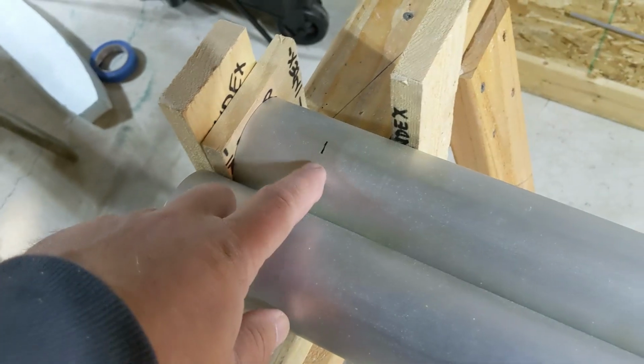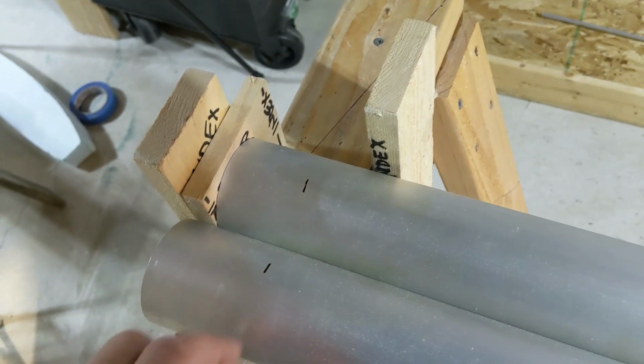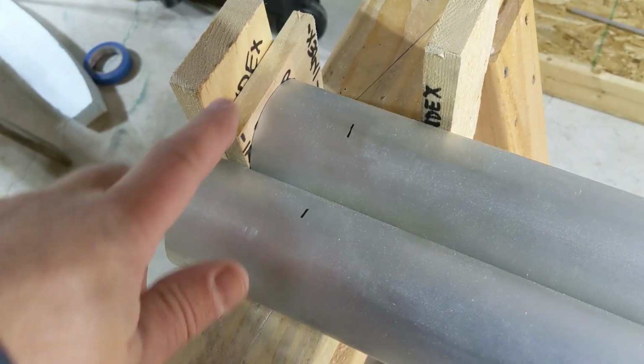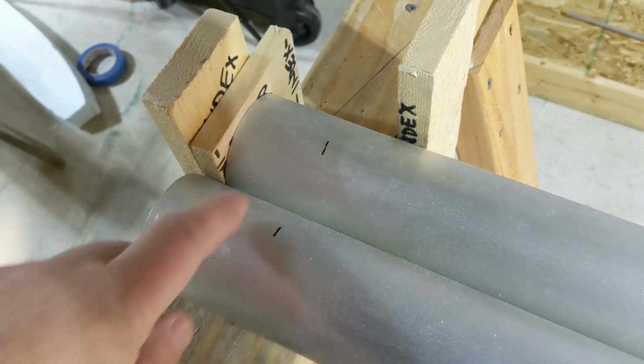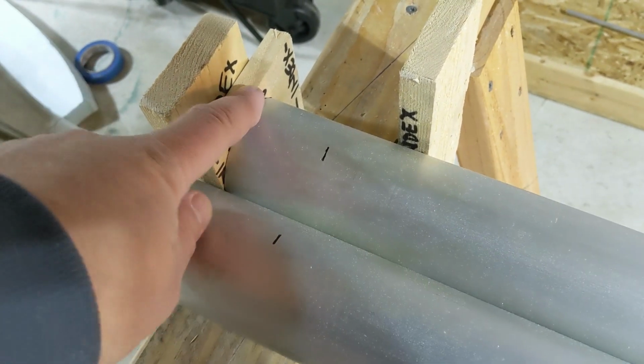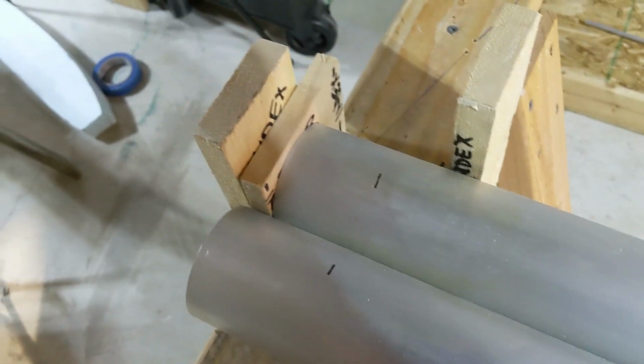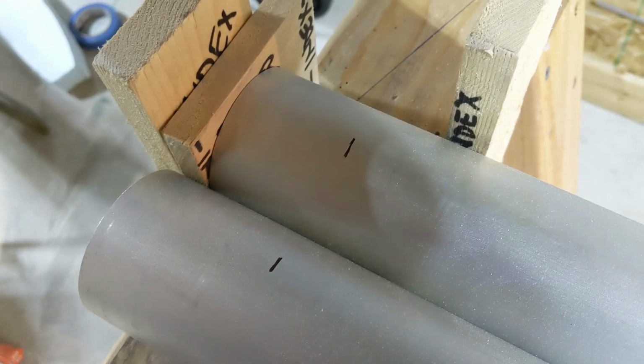So I did the measurements, just started with a Sharpie pen. Can't use a pencil on these spars because the graphite from the pencil will cause corrosion. 1/2-inch spacer block, aft spar. All of the dimensions in the manual actually come off of this face for the aft spar, and you have to add a 1/2 inch for the forward spar. But I thought after I got them laid out, I'd make a sanity check in case my horse math is no good. And so that one's pretty good.